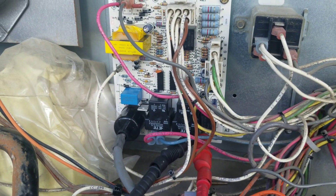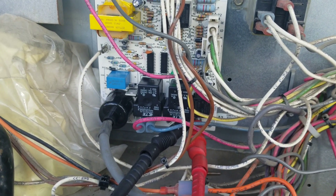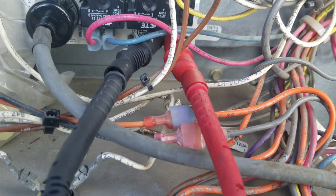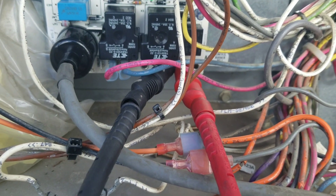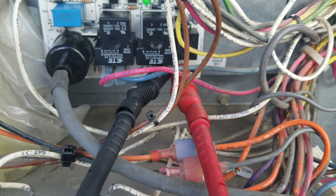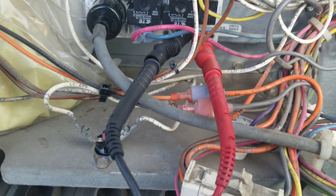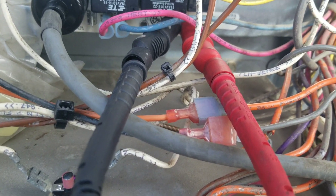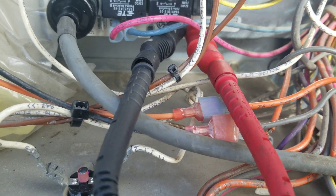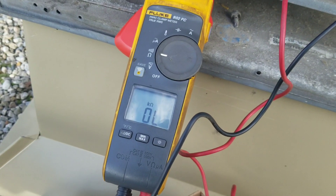The new board is in. If you want to take your troubleshooting to the next level, here's a step you can do: I didn't connect any power to the board. These are the blower motor wires, but the input for the blower and for the combustion motor has been taken out. I have my meter hooked up to the two terminals that are supposed to close on a call for heating.